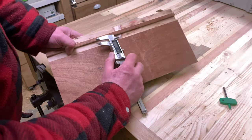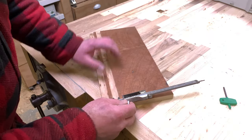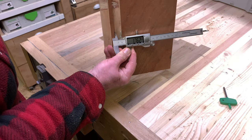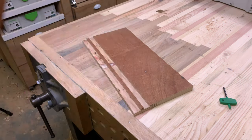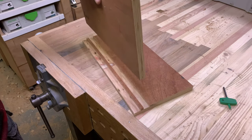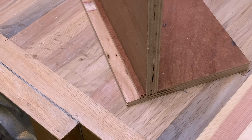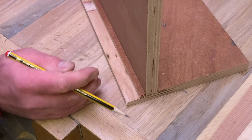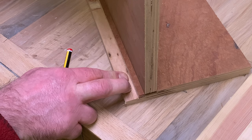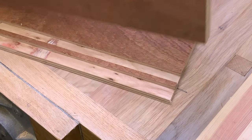Now this is going to look slightly unfair because we're messing around here with plywood that just isn't any good and just isn't a regular thickness like you would get if you stuck it through a planer. So obviously right now, when I stick this bit of plywood into that rebate, groove, dado, it just falls in there. It's not a tight fit, it's crap. And you can just see it, there's a 2.5 mil problem there, and that's not acceptable to me, that's for sure. You can just get the end of that sharp pencil in that gap.